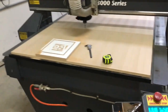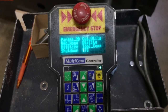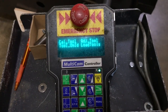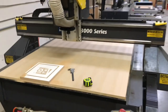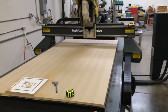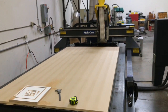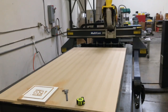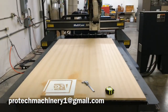When we're all done, we can go to shutdown and it'll put the tool away automatically. Or you can go to menu and go down to the tools under ATC for automatic tool changer, and tell it to unload the tool at any time without shutting the machine down. If I go in there and hit enter, I can hit 1 to unload tool now, then rapidly move the machine back to position 2. That's been a little bit of an overview on the Multicam 3000 series CNC router.